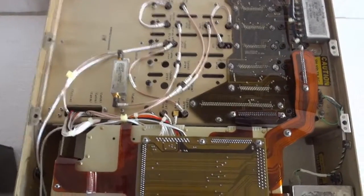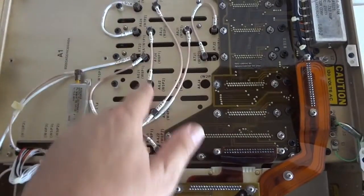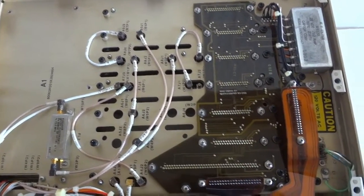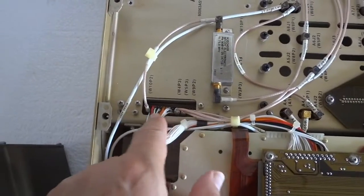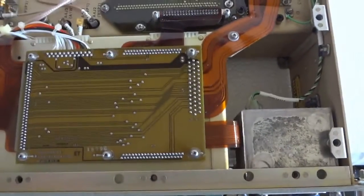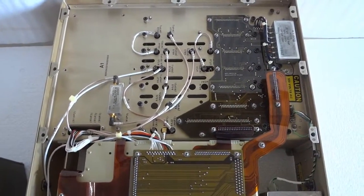Here you see the underside. This is the roofing filter at 75 MHz. All the modules are connected with SMB connectors. Here we've got some more filtering, and this is basically the motherboard. The synthesizer resides on its own chassis that plugs in here, and these are the input-outputs for the synthesizer. Here is the underside of the AC filter. And here is a distribution board — this is all with flex cables.